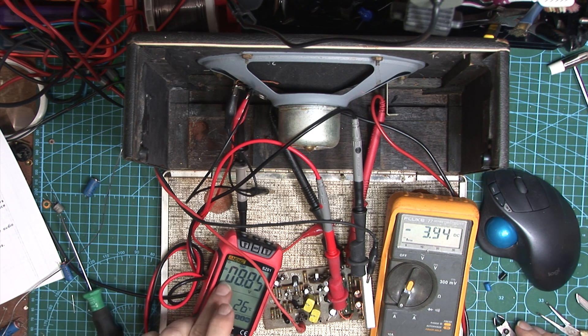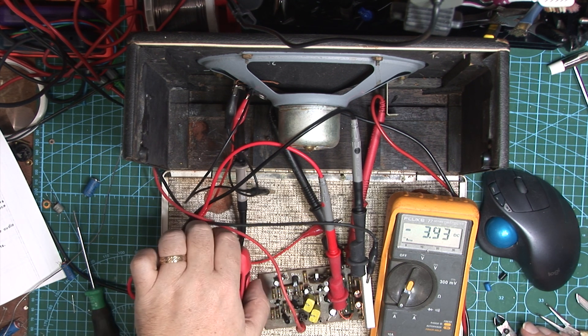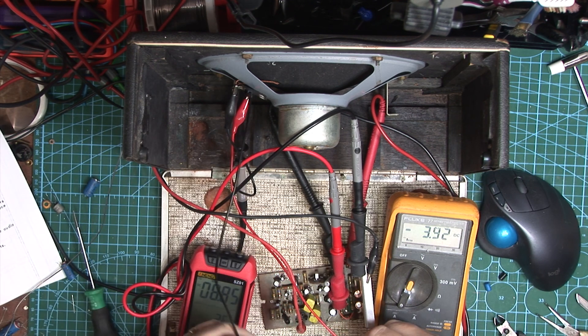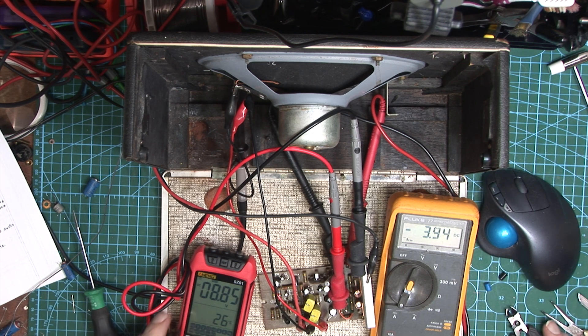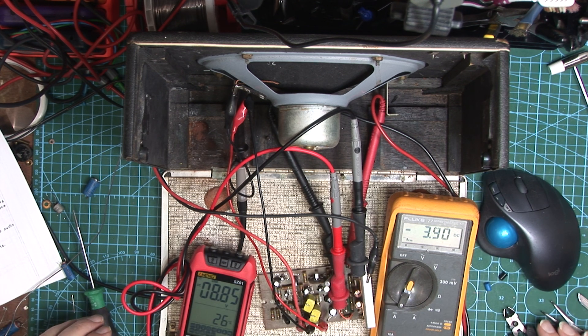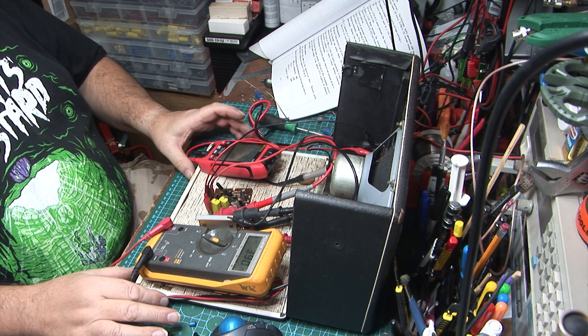Now we've got 9.45 volts on this point, so we need to change that to give a midpoint reading of 8.85 volts. That's brought it down to 3.95 instead of 4.15 — so that's that. Let's connect the speaker and make sure everything's right with the speaker connected, because it needs a load as well. With the speaker connected and the load on, we're getting 3.91 — good enough — and we've now got 8.86. Dead on, but you don't have to be exact because it's a radio amp board — it's not that critical.